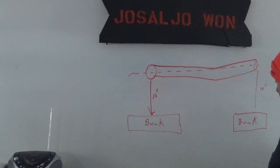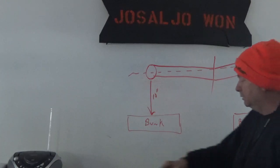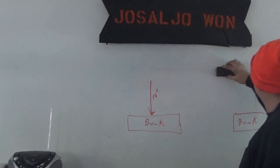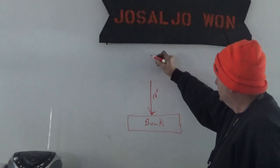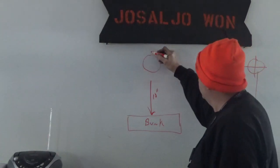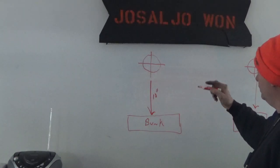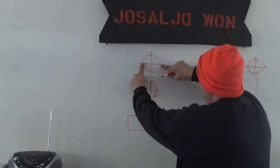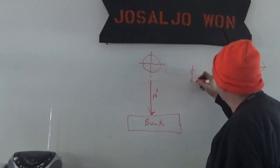You need to set this log in such a way that you get the most wood out of it. To be honest, if I had something that looked this bad, I'd take the chainsaw and cut it off right there and hope for the best. In order to center the log and cut through the center disregarding the pith, just take both ends, figure out where center is. You can eyeball it, or if you want to be more precise, do some measuring. Use a tape — if it's 10 inches, go 5. If it's 12 inches, go 6. Do it again and you'll get the idea. You might end up with a series of dots — just go to the center.